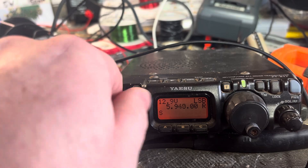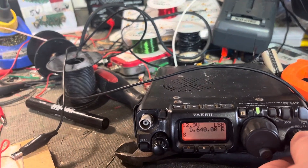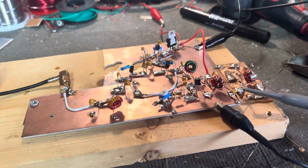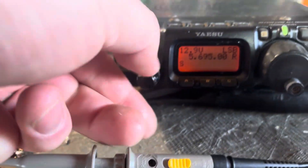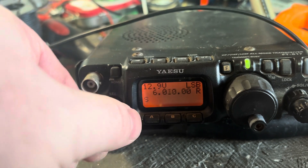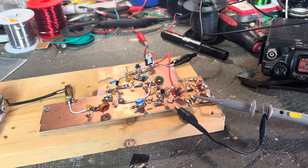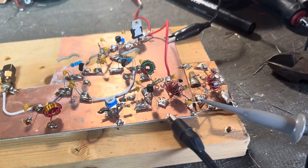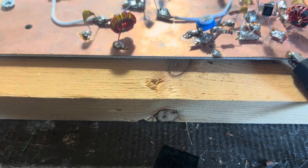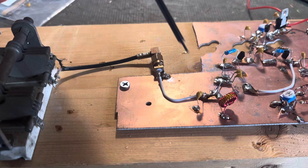The range: all the way meshed is approximately 5.629 MHz — let's hear the stability down there. And now bringing it all the way open to 6.041 MHz. So going all the way through — that is awesome! The bandwidth is approximately 400 kHz, so that's pretty cool.